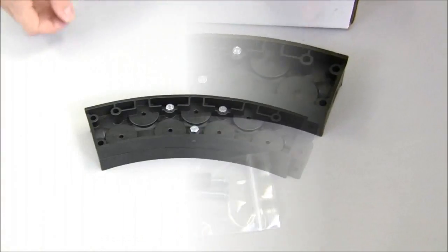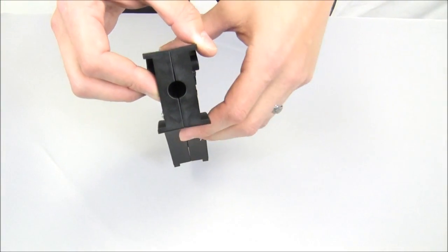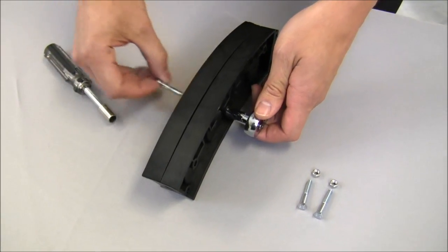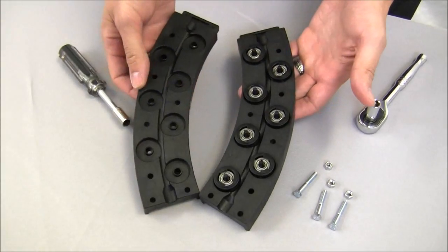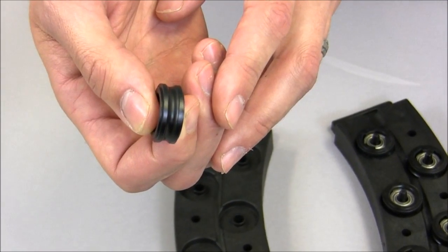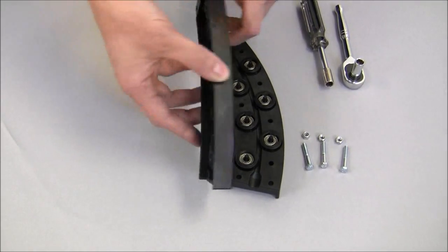Each guide module comes completely assembled and ready to add your appropriate size end cap kit or interlink additional guide modules with the included hardware. By simply removing the 3 center bolts, the guide module can easily be separated to access the internal rollers and wire pathway. The shielded roller bearings on the standard guide module unit have been pressed into a polymer U-groove wheel to allow use with both ferrous and non-ferrous materials up to 3/32 of an inch in diameter. The locating pins ensure proper placement of the rollers, create repeatability, and make reassembly easy should servicing ever be needed.